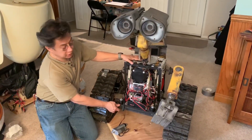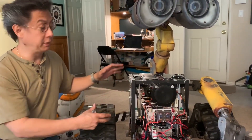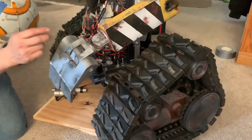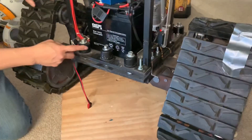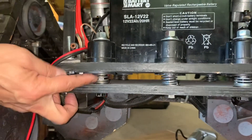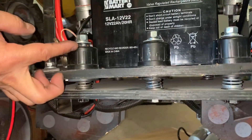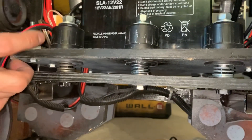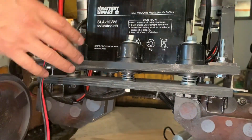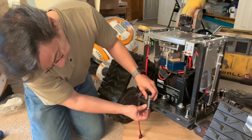The final set of springs gives Wally shock absorption. I have quite a few because I wanted to balance the load, and when he's fully loaded with his arms and everything, the body mainly floats on these springs. I have seven shock absorbers in there. I can't take this out right now, but if you look inside the mechanism you'll see a spring that goes all the way through and stops up against a PVC cap. Unfortunately I glued it on instead of using a screw-on cap, so I can't fully disassemble it — I had to take the entire mechanism apart several times over two days to get the balance perfect.